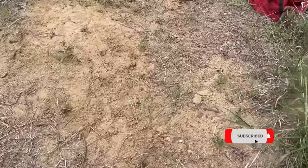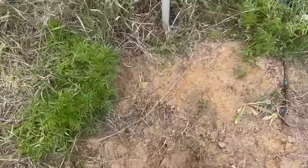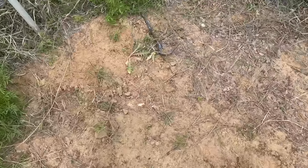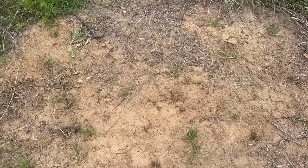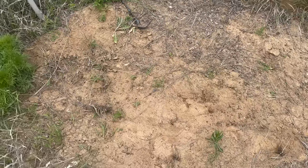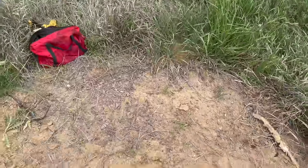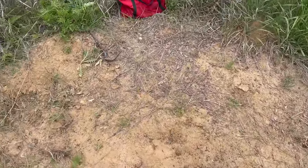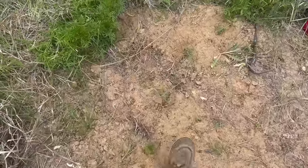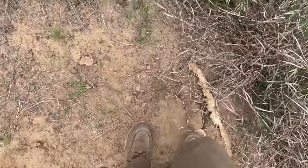We've got our septic tank right here. It's not too terribly deep but the customer does want risers on it. You can always find the septic tank if you don't have the plans — most of the time by finding the dead spot. You see all this nice grass and then this very obvious dead spot right here. There's going to be an inlet over here and an outlet over here — you can even see the handle on that one.